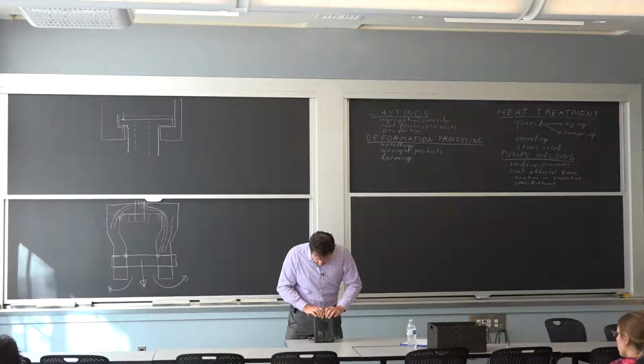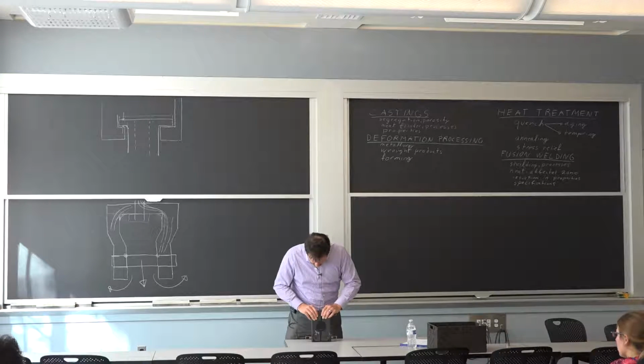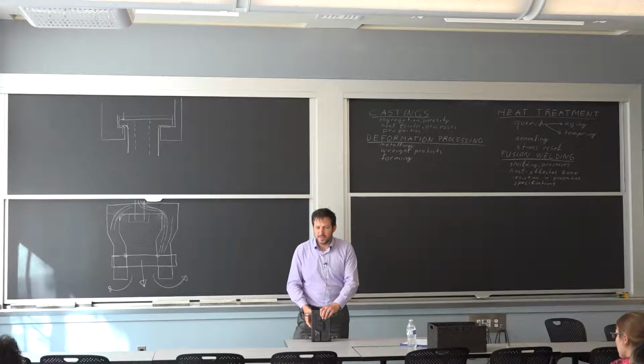The simple design, and there's a lot of variations of it, is these two C shapes. They come together and engage with high closing forces. To give you an idea, you're looking at 10,000 psi of difference in pressure from one side to the other. If you use solid aluminum, it will deform. So this is all steel, and it's supported from other components.